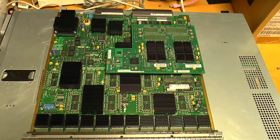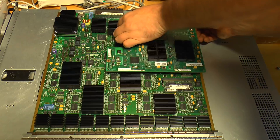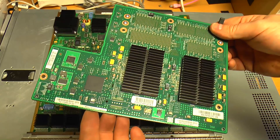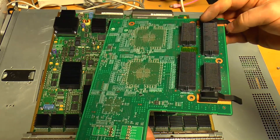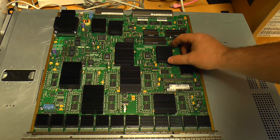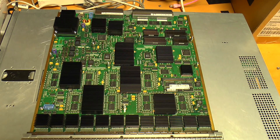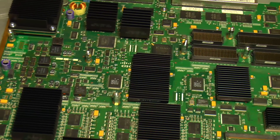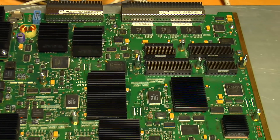Another card with a very similar layout is one of the four 48-port Gigabit Ethernet cards. This one has a newer version of the same CFC daughter card with smaller heatsinks, so you can at least see a little bit more of what's on it. Underneath, once again, it's a plethora of heatsinks on almost everything bar the RAM and the Xilinx chips. And this time we can't even see what the transceiver chips are because they've got heatsinks on them as well. But it gives you an idea of how much is in one of these switches — there's a lot of stuff in these things.